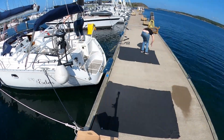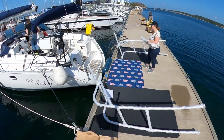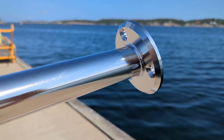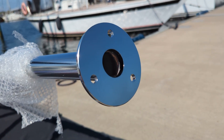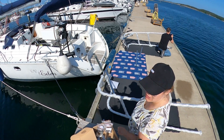We're going to put it on the dock to assemble all the pieces. This is a completely factory-manufactured arch, based only on the measurements we did a few weeks back, and produced in a factory completely according to our specifications. So hopefully it'll work perfectly. This whole arch has been polished by putting it into an acid bath, meaning it's polished everywhere — even underneath, and inside — polished to perfection. And it's all machine welded. Looking at these welds, it's just magnificent.